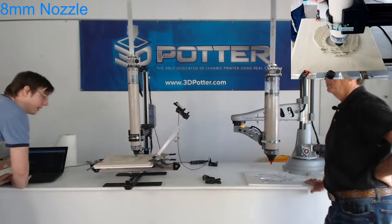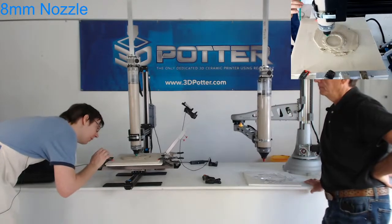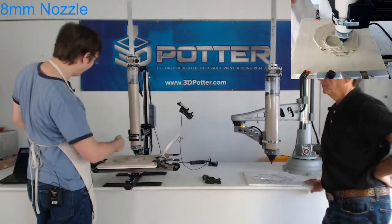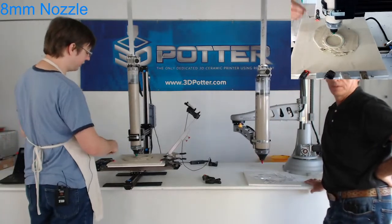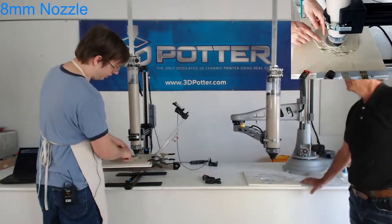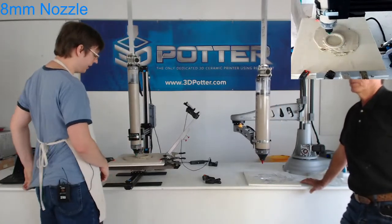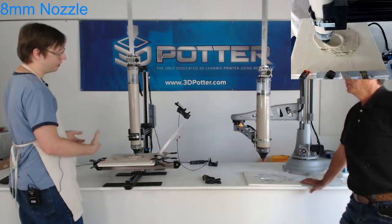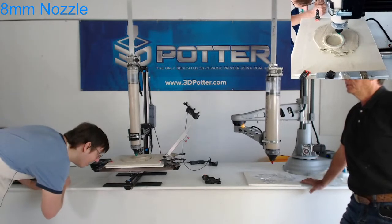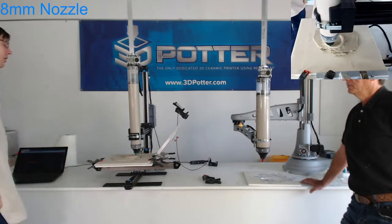And now I'm just inspecting the clay flow rate. We want enough extrusion to do loops. With Potterware, it's very, very good at doing loops and all kinds of designs on the pot. And in order to do the loops, we need a little bit more extrusion. So when it loops out like this, like whoop, the extrusion rate is enough to keep it as one solid continuous stream. The extrusion rate is pretty good.